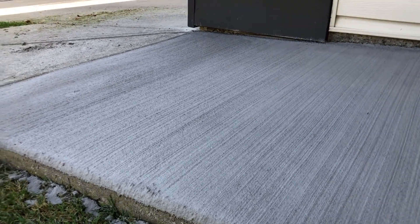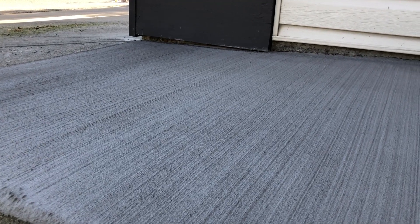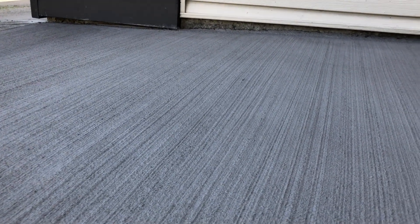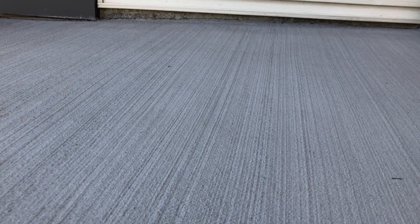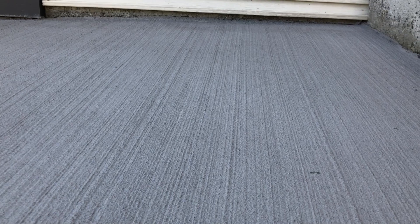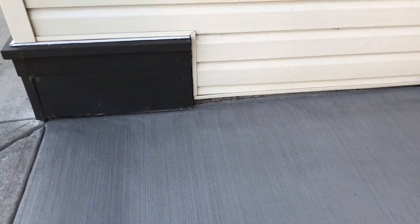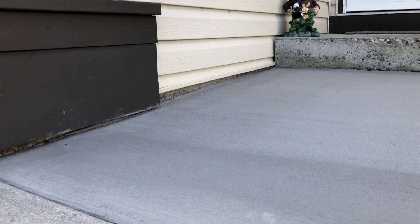There you go — there's a way to repair cracks in a concrete slab and put an overlay on it so it looks like a fully completed repaired slab when you're finished. This is only one of many methods, but it is quite effective if you're able to open up that crack and get a really deep repair so that both slabs fuse back together and have a nice solid base to lay on.